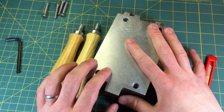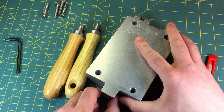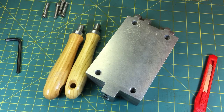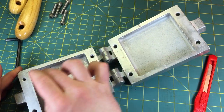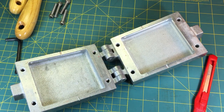So what you see here in front of us is a cool little kit that I picked up over 10 years ago, maybe closer to 15. It's called the Vulcamold, V-U-L-C-A-M-O-L-D. It is an at-home drop mold vulcanizing mold kit - not for spin casting. You see it makes this little square mold cavity, which is not designed for spinning. It's similar to what you'd do with silicone RTV molding, room temperature vulcanization. What's cool is this uses rubber very similar to what you'd find in typical spin casting, which means you can pour metal into it and it won't get damaged, or at least it'll last a long time. The only unfortunate thing is I don't think this little kit is made anymore.